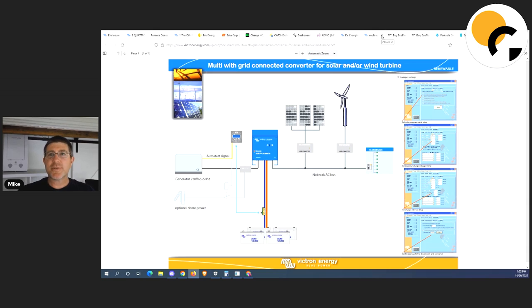I've also got another contactor inside the Victron I'm using. If you think about what I was doing with the Catch relay — I do have another circuit with the Victron that I'm turning on and off, activating a contact to control a load. The same thing you can do with the Catch relay you can actually do with the Victron. I've been using contactors and relays but it's actually just software programming — using the VE Config tools, which is pretty cool. I'll go into more depth on that in another video.